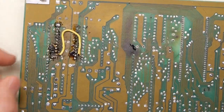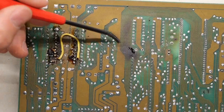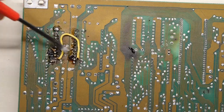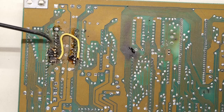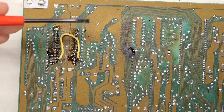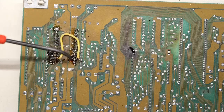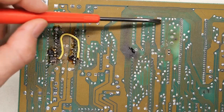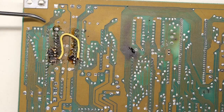When we flip the board over — oh, this is carnage. It looks like it's burned over here. What did they use to remove this chip? The very first thing I need to do is try to clean this up: remove this socket, get all this black gunk off, clean out the holes for the RAM, and let's see if we can revive this board.